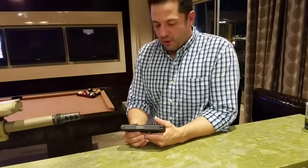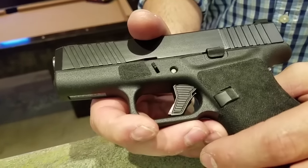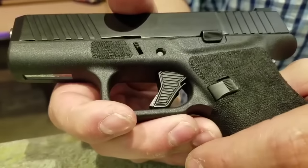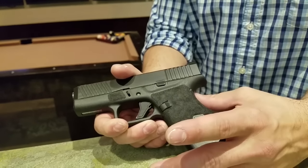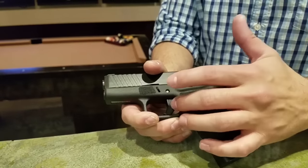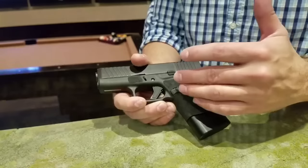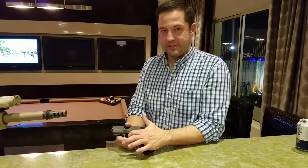The trigger is hundreds of man-hours of R&D. It takes about six operations between CNC and wire EDM, and we try to make it safer than OEM. The OEM Glock trigger is basically a polymer wishbone for the safety — that works because it's pinned within plastic. We call our safety the Bowie knife — if you remove it from the trigger body, it looks like a Bowie knife or machete. It's solid aluminum, just like the trigger itself, and it's pinned in there pretty good. You'll actually break the frame before you're able to force that safety to go back.